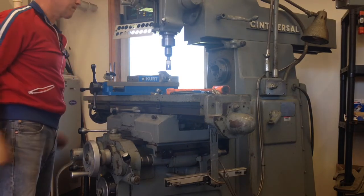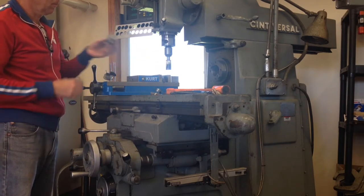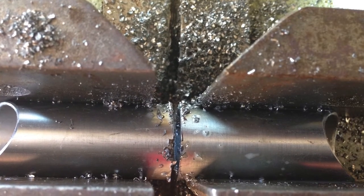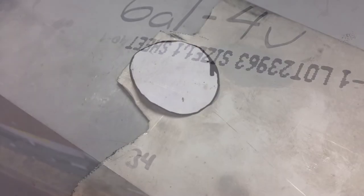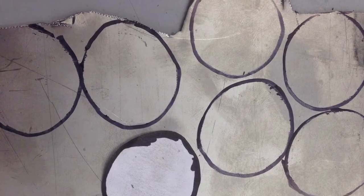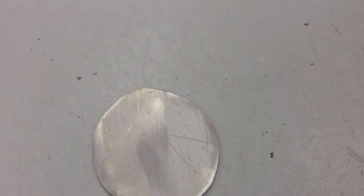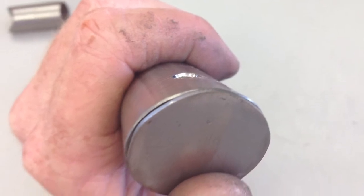It's a terrible mess when the wall tears out — really frustrating. So with our cut complete, we'll pull it out and clean it up on the outside and inside diameter. Next we throw it into the cold saw and cut the piece in half, giving us our two riser pieces. Now we grab some flat sheet titanium — this is 6-4 Ti. I traced around the center section to make a template and transfer it onto the flat plate, then cut out these nice little end caps by hand. You can see how they fit right over top of our center section, giving us good torsional rigidity.